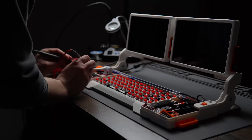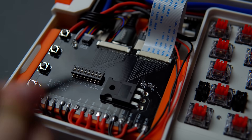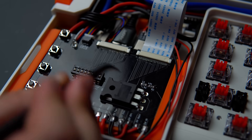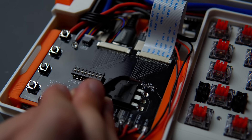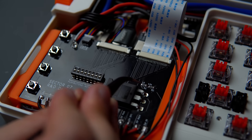Obviously, that was a little disappointing. After all that work, you expect it to at least do something, and instead it did absolutely nothing at all. So all you can do is get out the multimeter and try to figure out what went wrong. I found a problem. What I did to trace it was follow the 5 volts supposed to be turning on this MOSFET — we were supposed to get 5 volts but got almost nothing. Tracing along its path, the voltage dropped almost entirely across one resistor. That's because a 10-ohm resistor and a 10K resistor were accidentally swapped when I was soldering.